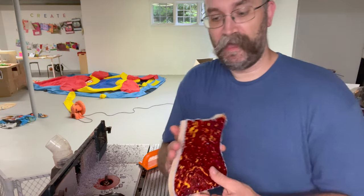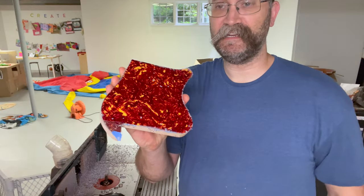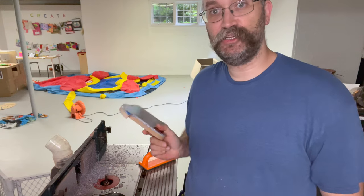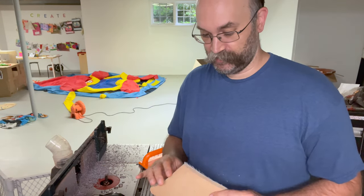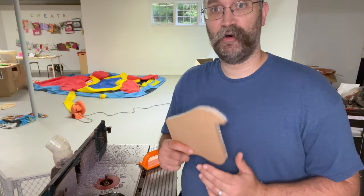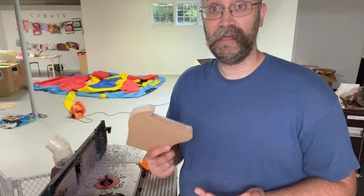So that wasn't too bad at all — I got a nice clean cut here, protective plastic notwithstanding. But you can see I actually got two very slight kickbacks there, which was surprising to me. I was climb cutting. So it just goes to show that even if you don't expect there to be an issue cutting something, you can get a kickback.